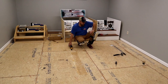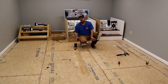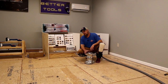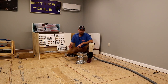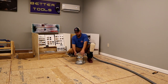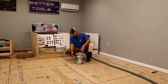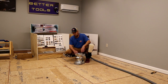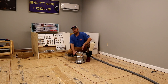All the wood is up, staples are cut off flush with the floor. I'm going to clean this up and do one more thing to get the subfloor ready for whatever type of flooring we want to install next. I'm going to take my floor edger — a floor sander with a seven-inch sanding disc. If you don't have one, use a belt sander or palm sander with a rougher grit, maybe 40 grit or even 30 grit for the palm sander. This edger has about 30 grit on it, so it'll eat it up pretty fast. Keep it moving so you don't cut a groove in the subfloor. This is only going to take about two minutes and the floor will be completely sanded smooth and ready for the next installation.